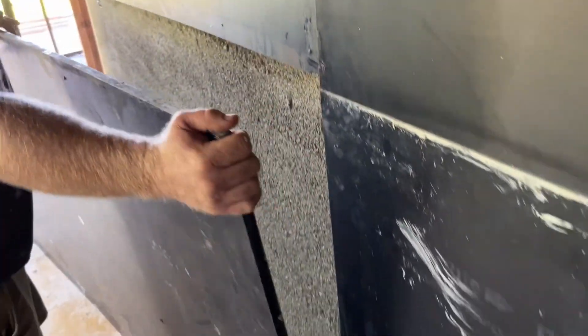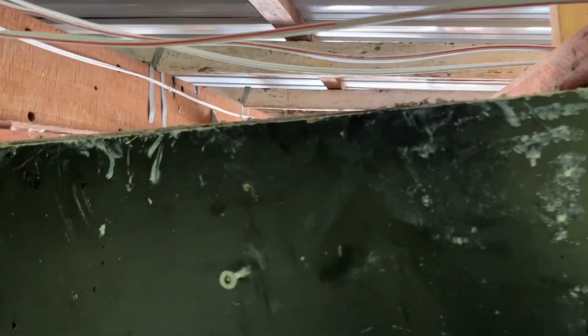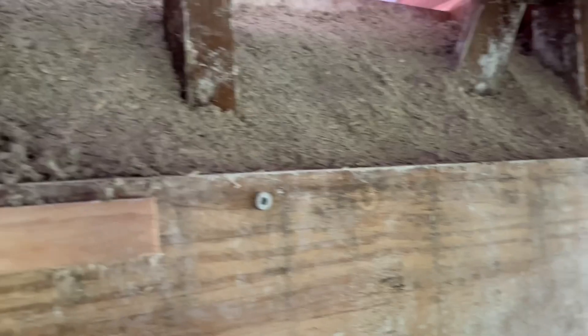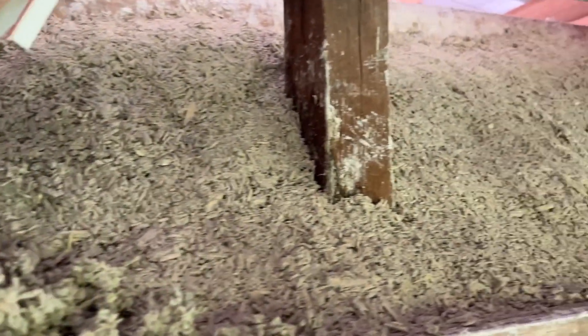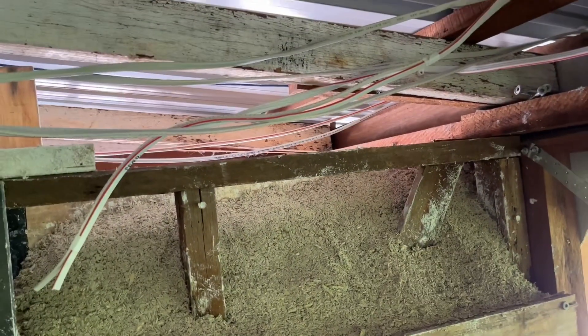Here's a beautifully formed wall — a great result from an extreme DIYer who brought some birthday magic to the job. Near the roof cavity, ramping up gets harder and harder as you try to sneak hempcrete into the top. With a pitched roof leaving more room on one side, the other side will require handfuls of hemp pushed in over the rafter — a challenge, but they'll get there.